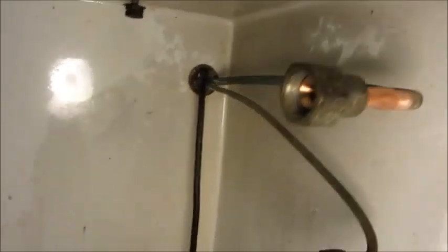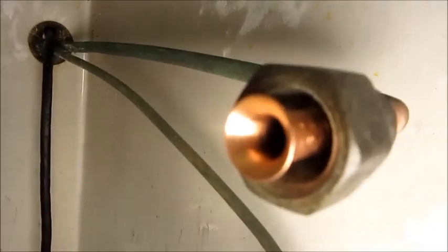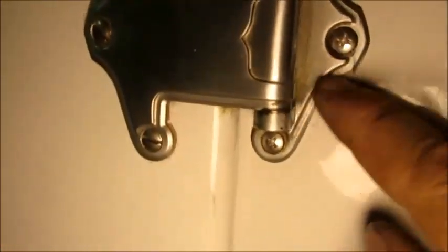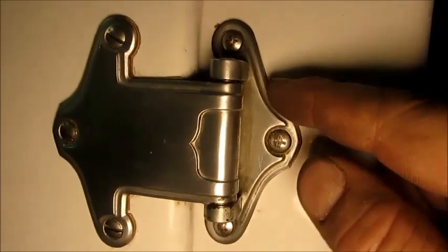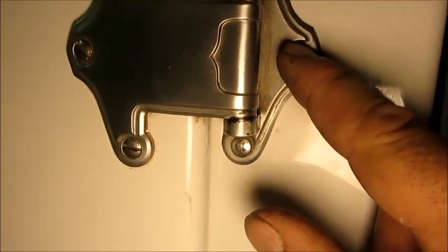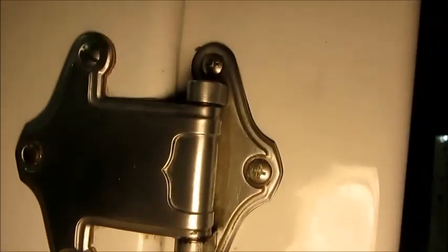Hopefully there won't be a restriction or a leak path. I did a little progress on this Frigidaire — I showed the new line connection that I created earlier, and I got that installed. I also fixed these hinges so that they're shifted upward and the door is properly aligned. Sadly, the original slotted pan head screws were structurally deficient, so I've temporarily put those in there to make it safe to keep the door on. I put a new spring inside the latch so it's not weak anymore, and a new door gasket.